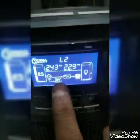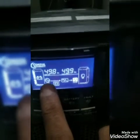Battery indication is glowing. Next, I will check it out for load ON bypass. Before shifting load ON bypass, my input should be ON, so I am going to turn ON the input breaker. As I turn ON the input breaker it will take some time. Right now this is ONLINE. You can see in the block diagram — input feeding to battery also for charging, and also goes to inverter and via output.